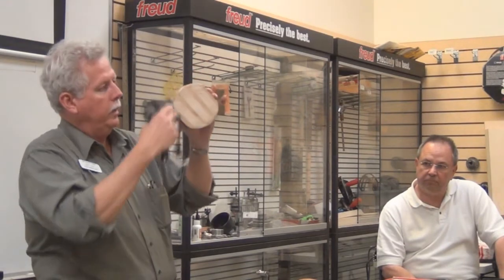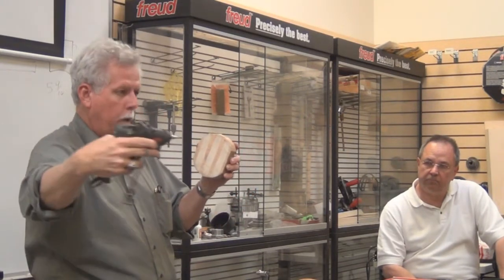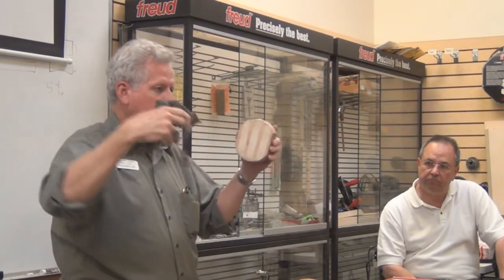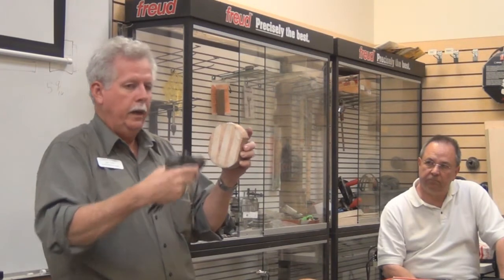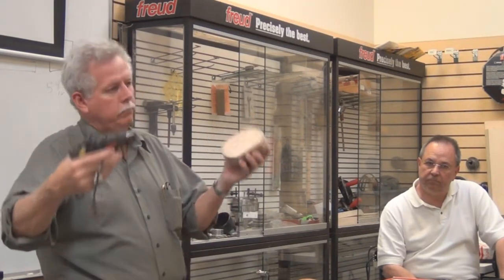Some days your normal stuff just doesn't work and you don't know why. If it doesn't work, try something else. There's no magic to it. You take a face plate with a block of wood on it, put the glue either on there or on the foot of your piece. Put it between the tailstock with the appropriate size cover, push it up while the glue's still hot. Marry it together and let it sit until the glue hardens. Then you can pull your live center away. If you do enough, you learn what will hold and what will break apart. A lot of people put one more bead around it.